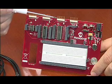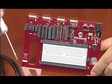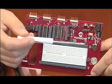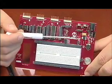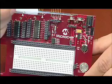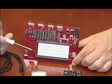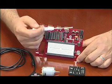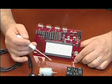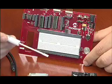You'll also notice that each socket has its own dedicated ICSP connector so that the PICkit-2 programmer debugger included in the kit can individually program the microcontrollers populating the board. We also have an onboard voltage regulator that can regulate voltages to the micros from 1.3 to 5.2 volts off of a 9-volt battery or a 9-volt DC power supply. That's really good for battery-powered applications.